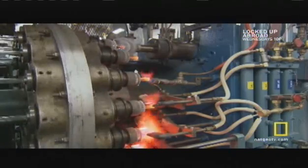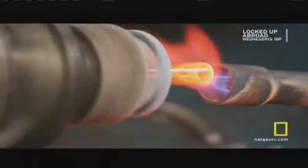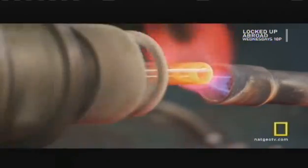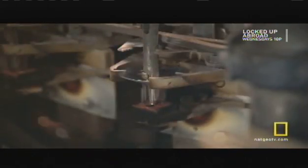To make the flare, miniature burners blast a half-inch piece of glass with heat. Then two metal pins are inserted into the glass and spun outward to form a funnel shape. Once the flare cools, it's delivered to a stem machine where mechanical arms pick up the lead wires and drop them into the flare. Then the sealing machine mounts the wires in the glass.